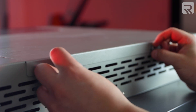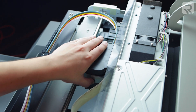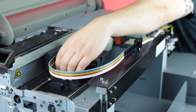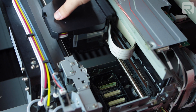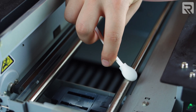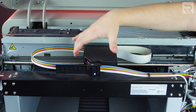With monthly maintenance, you'll want to start by checking your air filters to make sure they are clear. You'll also need to re-grease the rails that your printer carriage rides on. To remove the old grease, simply slide your printer head over to one side of your machine so it's out of the way and wipe the rails down with a lint-free wipe. Once you wipe your rails down on one side, slide your printer carriage over and repeat the process on the other side. As you're doing this, make sure that your printer head does not cross into the maintenance station. Now that we've removed the old grease, we're going to apply about a pea-sized amount of new grease to our applicator and gently rub the new grease onto the top of your rails. Once we've applied our new grease, we're going to gently exercise the printer carriage by sliding it back and forth just to make sure it glides smoothly.